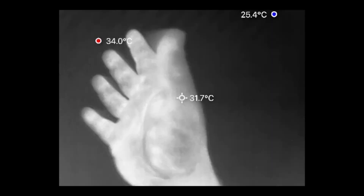So that's 10 times the number of pixels as the FLIR 1 Gen 3, sitting well above the FLIR 1 Pro and in between the Seek Compact and the Seek Compact Pro. Truth be told, you don't need the same resolution for detecting heat as for visible light, but you still need to be able to make out what you're looking at. The resolution on the FLIR 1 Gen 3 is so low that they added a visible light camera to overlay on the thermal image. The FLIR 1 Pro also has a visible image overlay. Like the Seek thermal cameras, the P2 Pro doesn't have an additional visible light camera built in, but I would argue that it's not necessary — the thermal image is clear enough to make out exactly what you're looking at.